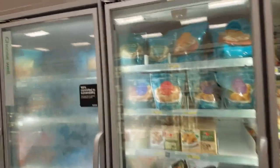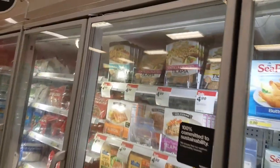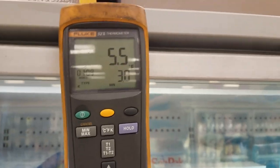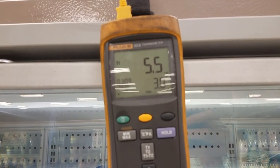Okay, I'm here at my call. Let's see, I got my frozen food case right here. It's showing that it's running about 0 degrees right now. Got my Fluke on there and it's showing a minimum of about 3.0 degrees, so yeah we're running a little warm.